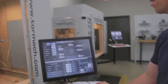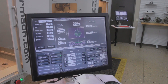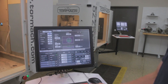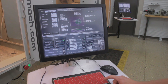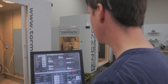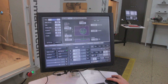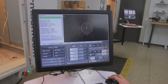We go over to the conversational tab and select Circular Pocket — there's a rectangular pocket as well, but we're doing circular for this. I won't go through entering all the values; they've been entered correctly and you can see them in section 5 of the manual. I will point out that you can hit enter to move between fields, and the nice thing about that is if you accidentally type the wrong value, it'll check the value for you and won't let you get away with something that doesn't make sense — you can even see in the status screen "invalid Y value." I've given it a name, "first part," and I'll click Post to File, save it as firstpart.nc.